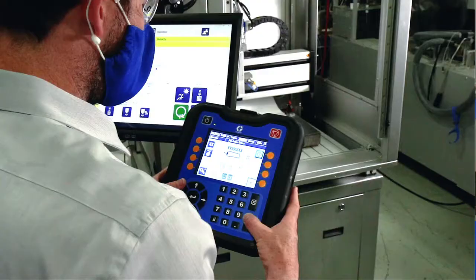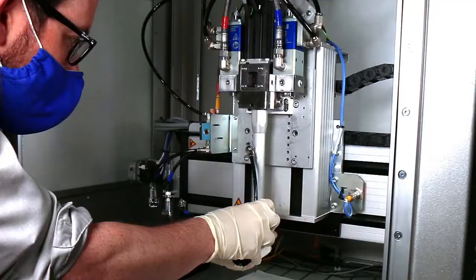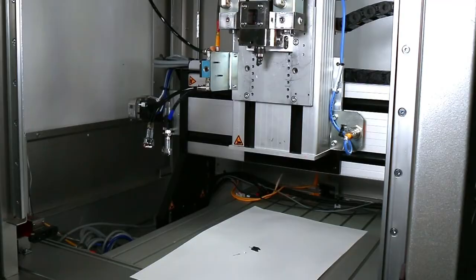Integrated dispense delay controls monitor ramp-up time, RPM, and torque to prevent broken mixers and inconsistently mixed materials. Disposable mixing elements, long-lasting rotary seals, and sturdy components stand up to tough-to-blend materials, making maintenance and cleaning quick and easy.